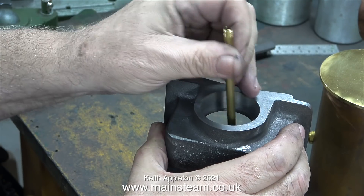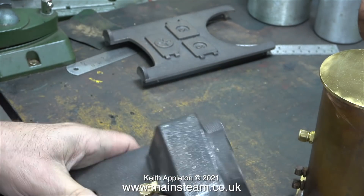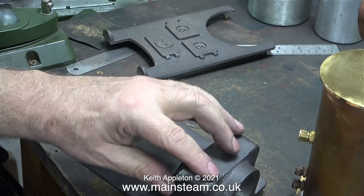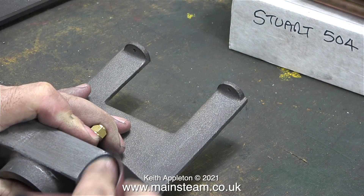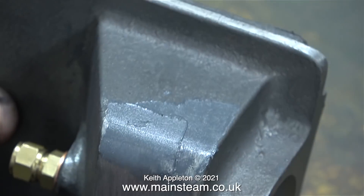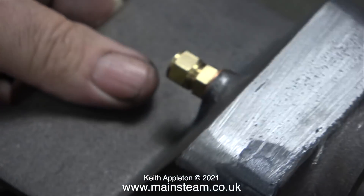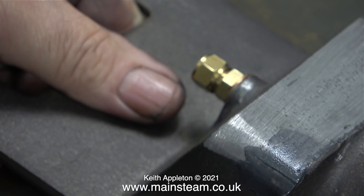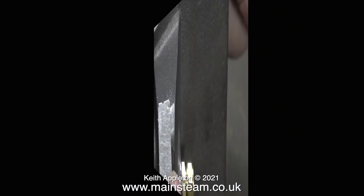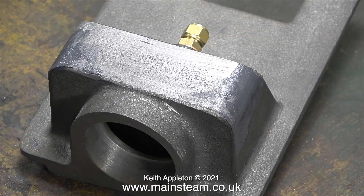Health and safety — I've removed the part so I don't poke my eye out. Here you see the finished job. Now it's time for a bit more fettling and some filling. For filling the casting I'm using some JB Weld — I do like this stuff, it's very strong and it seems to be more than heat resistant enough for the jobs I use it for. I also filled a couple of blow holes underneath this part.